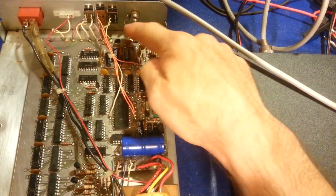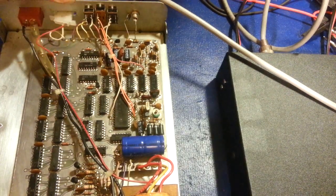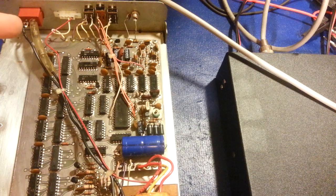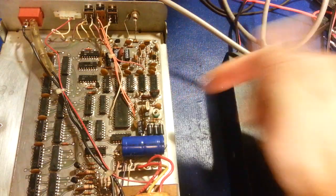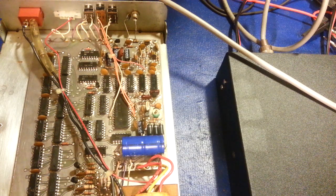But it's basically just unsolder two wires, unscrew those switches. Like I say, this still needs to be fixed because that just pops out, so no problem there. And then unsolder the 220-volt line wires right there, actually the wire and then the fuse. And then you can fold this board up and you can get to the underside to work on it. But yep, that's the problem. Bad trimmer capacitor. So otherwise, it appears to be working just fine.